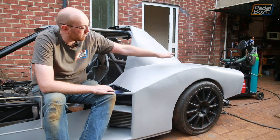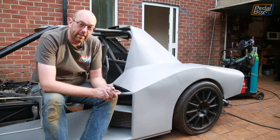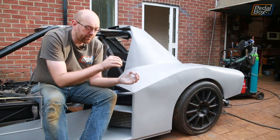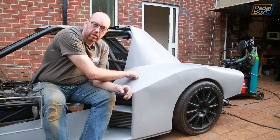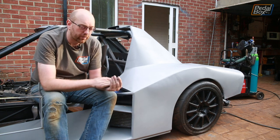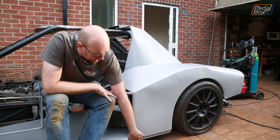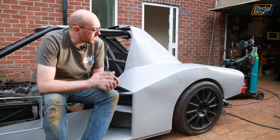The back of the panel that comes all the way across here, that very far edge around the back where the rear light cluster is, needs to be rounded over. You can't have a sharp panel edge. I mean, this is 0.9mm steel that we've made it out of, and you have to have a 2.5mm radius on all of your panel edges for the SVA, which is why these are rolled over, these are rounded, everything. So we need to do something for that.